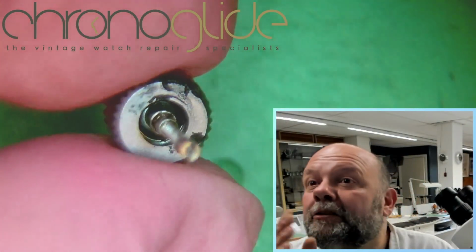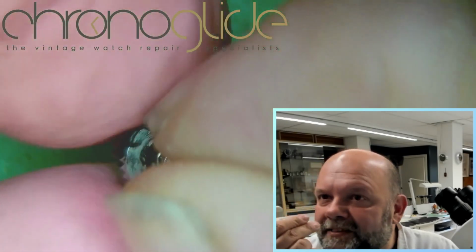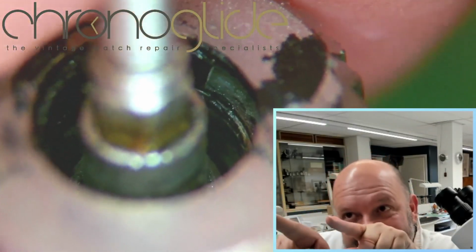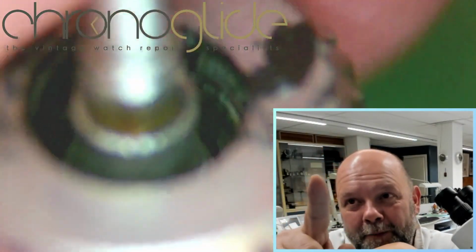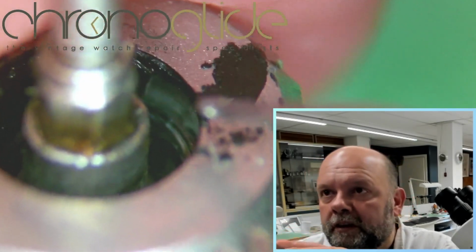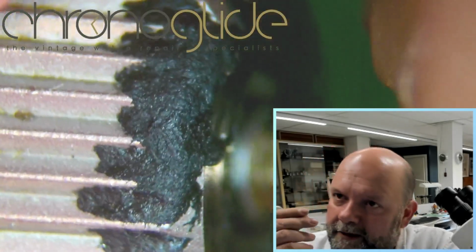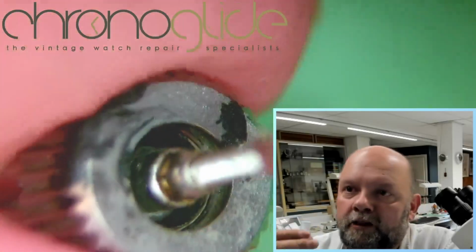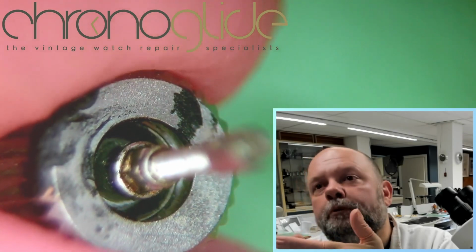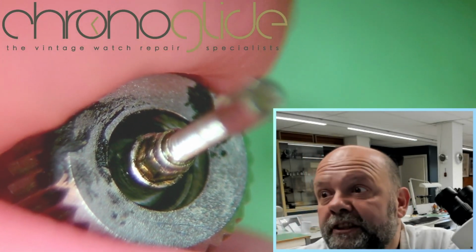And now here you can see the crown before I cleaned it. The rubber is so deteriorated that it's becoming a paste, and it's everywhere, makes stains, quite horrible. What I show you now, on the inside you see on the left is a bit of rubber left, and the rest is completely gone. We see it a lot with Tissot gaskets from the mid-70s. I think the vulcanization of the rubber just didn't go well. This might be even that the rubber deteriorates from salty water, chloride from swimming pools, or oil, and the rubber becomes a paste and no waterproof seal whatsoever.